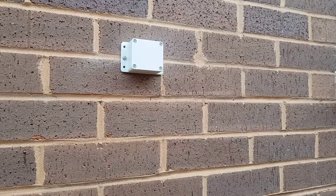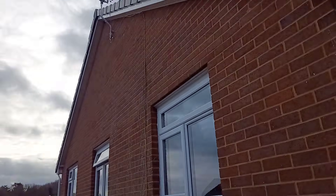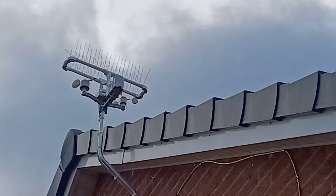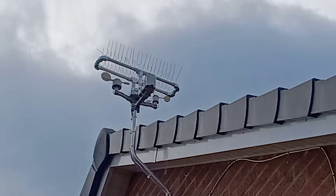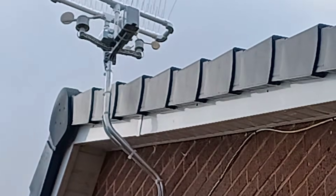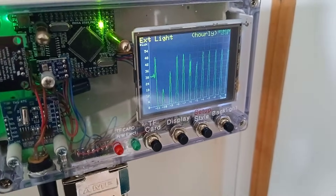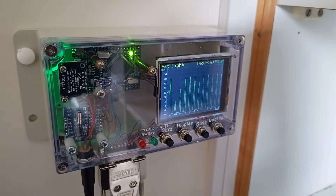This box on the north wall of my house has the external BME280 in it, wired straight through the wall to minimise the length on the I2C bus. The other sensors are up near the roof. We've got bird spikes above them, then a rotating cup anemometer and a wind vane, and a tipping bucket rain sensor. In the junction box in the middle there is a photodiode and an LM741 op-amp to amplify the signal. We can see the light readings there, roughly calibrated using an app on a smartphone. The firmware is available via a link in the description.